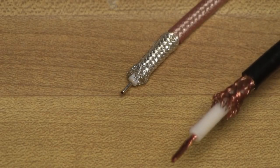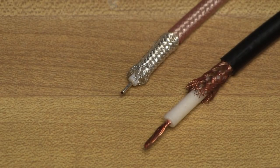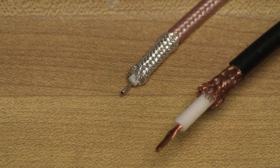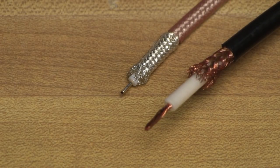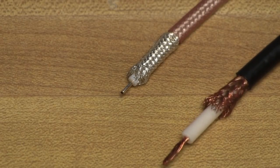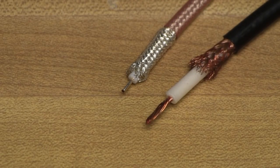Let's do a few comparisons. RG-8X, which we're all fairly familiar with, is a similar size coax — it's usable out to 1 gigahertz. RG-142 is usable to 8 gigahertz. The loss of RG-142 is a little higher: at 100 megahertz, RG-8X has an attenuation of 3.1 dB per 100 feet, while RG-142 is 3.8 — a little lossier. But look at the power rating: at 100 megahertz, RG-8X is good to 250 watts, while RG-142 is good to 2,400 watts. I like to use it for critical jumpers, broadcast installations, and sensitive test equipment in high RF fields.